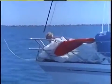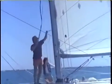The blooper is tacked by a pennant outside the bow pulpit. The halyard for the blooper is rigged outside the spinnaker sheet, so the blooper itself flies completely to leeward. The blooper sheet is led over the boom directly to the stern.